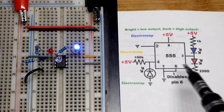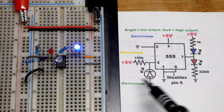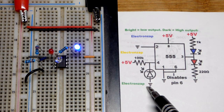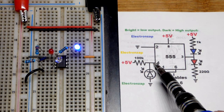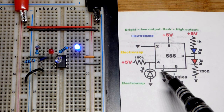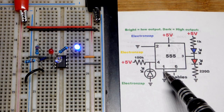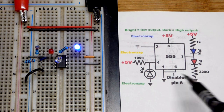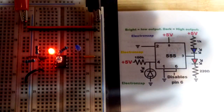In this video we're looking at the 555 timer controlled by a photodiode. That's not an LED — it's a photodiode, reverse biased. There's enough light on it to give a low enough voltage to pin four, close to zero volts, to force the output low. That's what the reset pin does: a low input to pin four forces the output low and it stays low. You can see the blue LED is lit up.